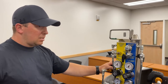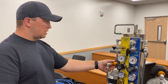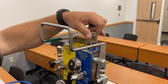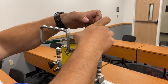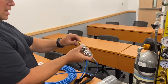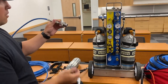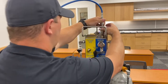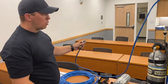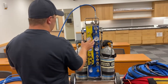We have multiple 60-minute cylinders on rescue and hazmat. If we need to use more cylinders, we can take the quick-disconnect nipple off of our 45-minute bottles — these connections will thread onto those bottles as well. On the top we also have a male connection for a hose that attaches to our air trailer. This blue hose, with the same connection on both ends except one end has a bleeder valve, allows us to have continuous supply of air from our air trailer. One end threads onto the top and the other end connects into our air trailer on the lower left side of the back panel, so we don't have to be replacing bottles.